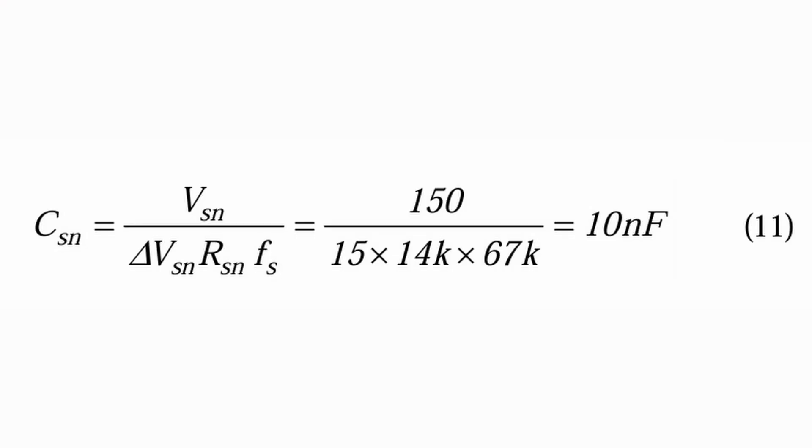Lastly, the relationship between the snubber's capacitance value and its power dissipation: if you need to reduce the peak voltage spike, the way you do that is to increase the snubber's capacitance value. Doing this will also result in a lower resistance value for the RCD snubber, and as we've been discussing, lowering that RCD resistance will increase its power dissipation. I hope this video about flyback RCD snubbers was helpful. There are multiple other areas in power electronics where snubbers are used, and those are more designed for EMI purposes, but the methodologies and concepts are similar. Thank you for watching.